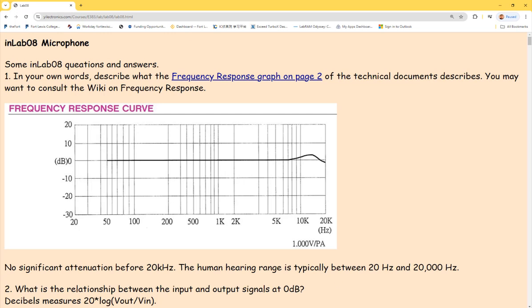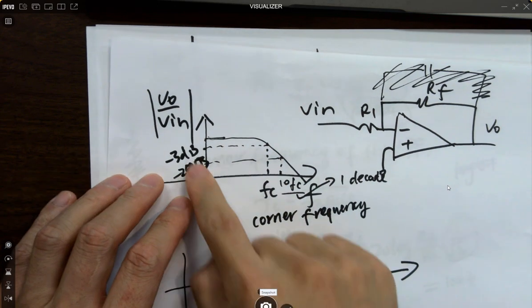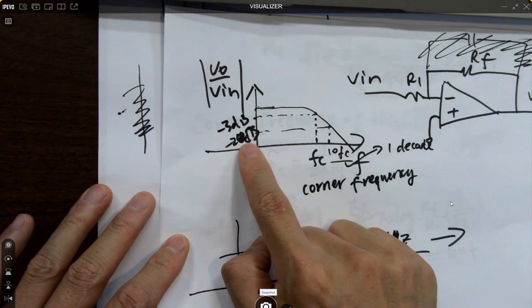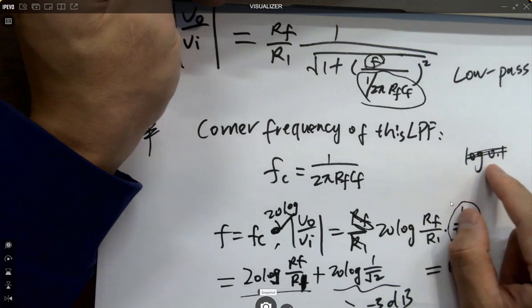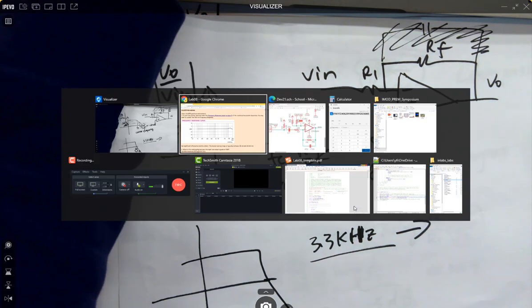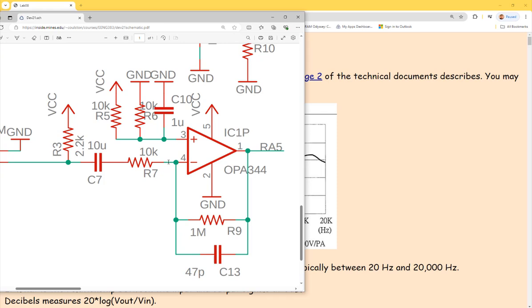If it's on the ramp, it's going to be 20 dB attenuation. If you see that, still treat it as 20 dB attenuation. However, you just have to know there's a DC gain still existing, even though this is attenuating by 20 dB. In here it's actually 10 times smaller, but since you have 100 times DC gain, eventually it's still amplifying by 10 times. If the signal is not attenuating, what's the DC amplification gain for this circuit? 100, because it's 1 mega divided by 10K.